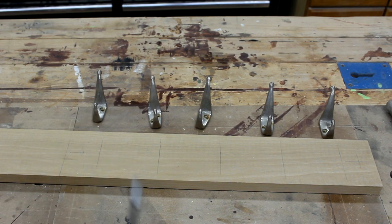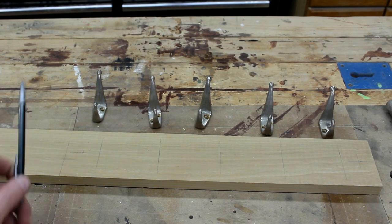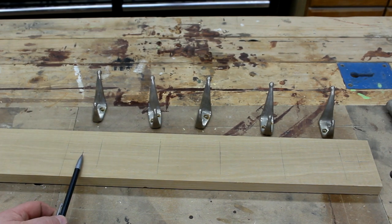Here's our board laid out. I measured off this edge 18 inches because that's what I'm going to be using — you can make yours any length you want. Because I want five hooks, I came in from the edge two inches on each side and made marks. Then I split that difference and got my screw holes, so this is at one inch, same at the other end.